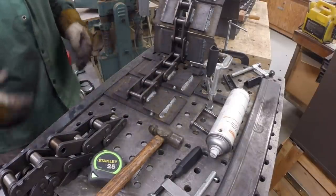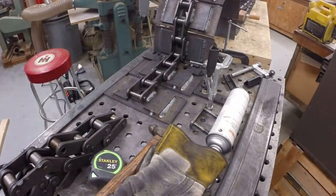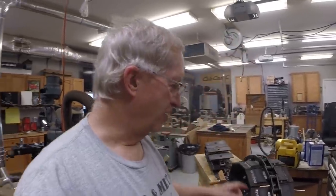All right, done welding up the track. We let things cool. So that's the last of the track plates. Track is welded up. It's taken me, I think, four different short sessions, trying to follow the advice of not exceeding the duty cycle on my welder, which I had not done in the past since I started welding any of these plates up. So it's just taken shorter sessions, and going to do something else.